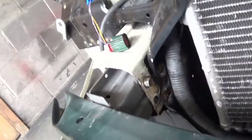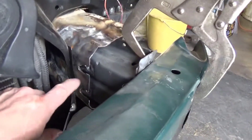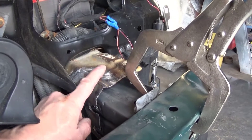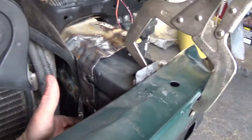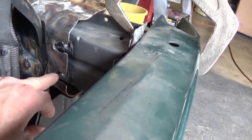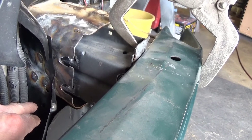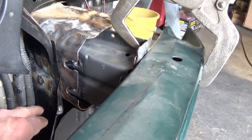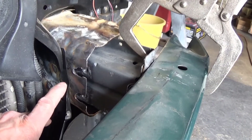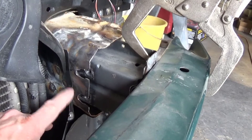I've got it in position with a few bolts in place and all the holes are lined up except for these — the others on the other side lined up, but what's happened here is this tube is twisted down and the holes aren't lined up. So I'm going to have to cut out more material, then weld a washer — or I may take a piece of 14 gauge plate and drill some holes in it. I haven't decided yet; I may just use washers to be quicker and easier.